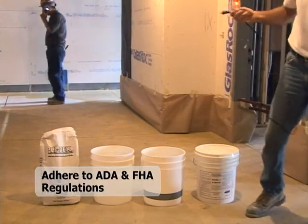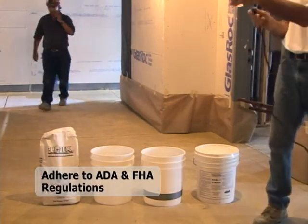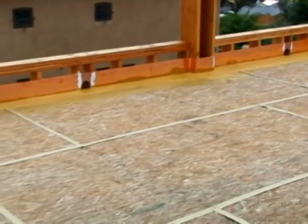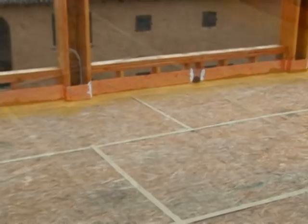Local building jurisdictions may vary on the 4 inch balcony differential. Plydeck has tested their product over exterior plywood sheeting as well as OSB oriented strand board. Plydeck requires a minimum 5/8 inch sheeting but recommends a ¾ inch tongue and groove plywood sheeting over standard joist spacing of 16 inches on center.